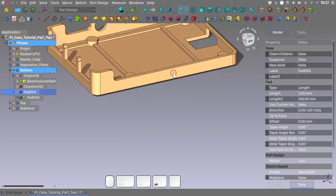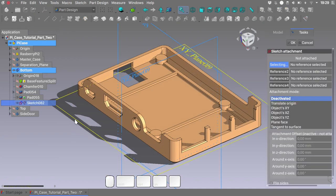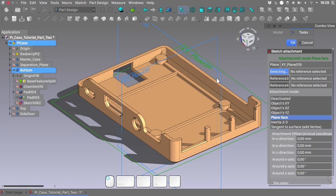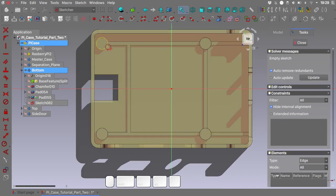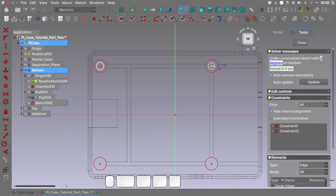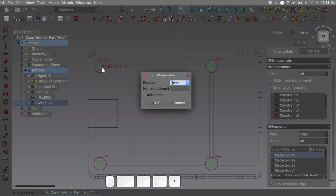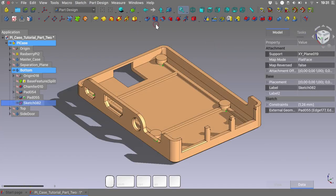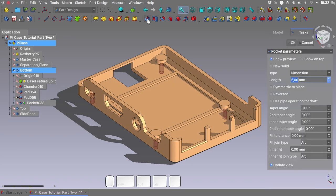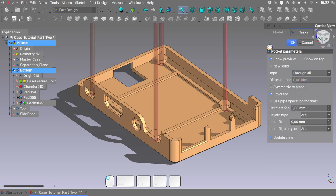And magically we have thicker pads. Let's create another sketch on the XY plane. We will import this external geometry — press E on your keyboard and a radius of shift+R 1.26. Hit close. Let's pocket our sketch, reverse the direction, and through all.